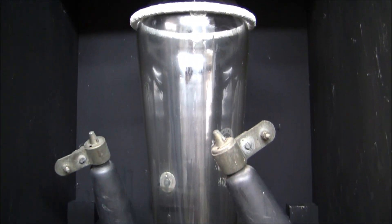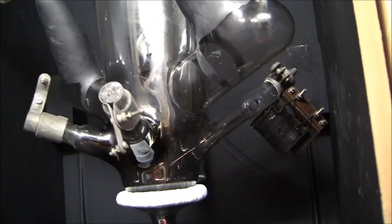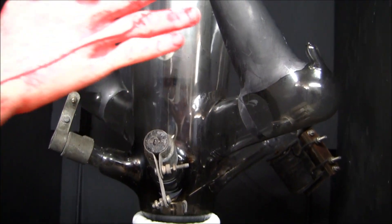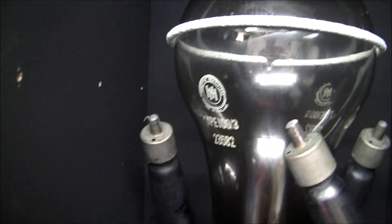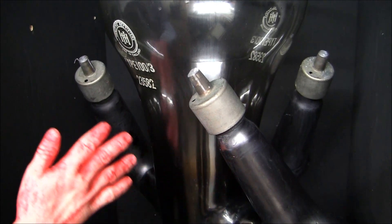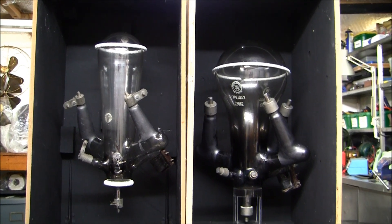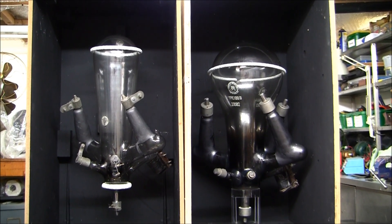This one is for single phase operation with two anodes. The exciter anode and the starter anodes are common for both. However, as the single phase has two anodes, the three phase has three anodes. For six phase, the secondaries of the three phase transformers are arranged to be 180 degrees apart.